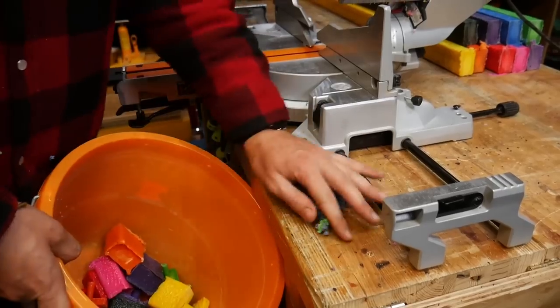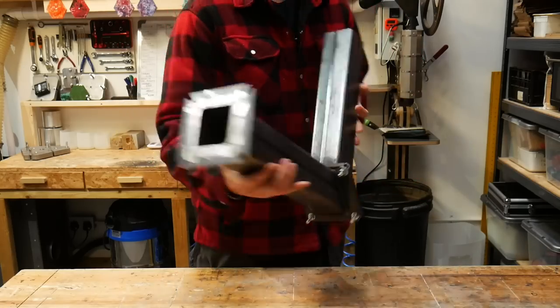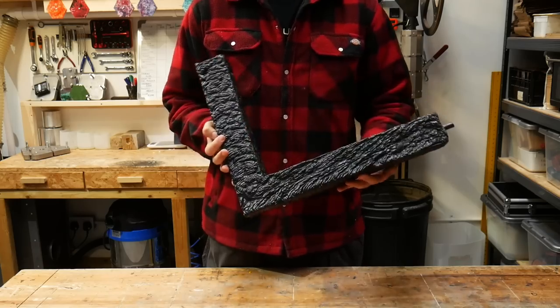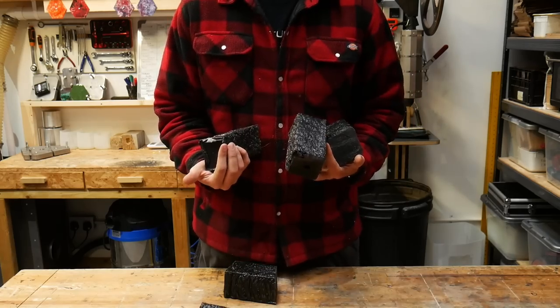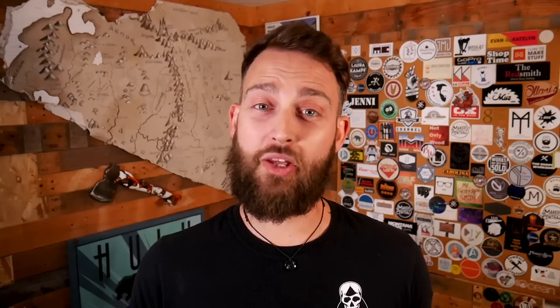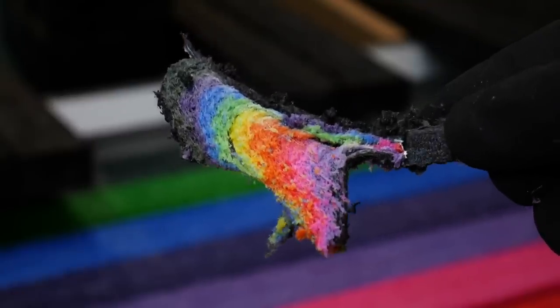Polypropylene is no different to HDPE in terms of the waste produced — we can save everything, shred it down and recycle it again later. Regular pallets tend to have big chunky corner blocks, so for this we busted out one of our bench leg moulds as this has a much bigger cross section than our regular beam mould. Well, that was easy! One thing we did notice when cutting polypropylene compared to HDPE is that all the swarf kind of fuses itself back together. This makes the clean-up job really quite easy, but also gives you these really funky little plastic rainbow blobs.